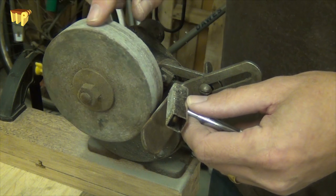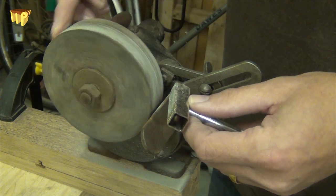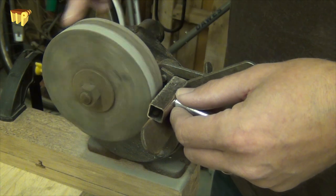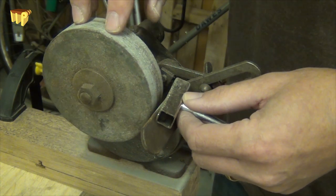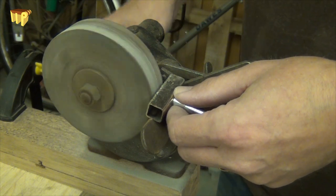You also find a patch here where we're actually grinding right the way across. So the whole stone was obviously a little bit high here and a little bit low over the other side of the circle. We gradually just take that bit by bit until the whole stone has ground evenly across and we don't get that juddering, which suggests it's out of round.